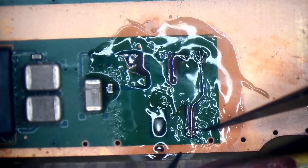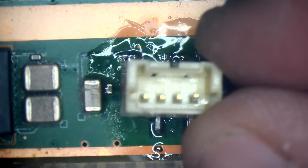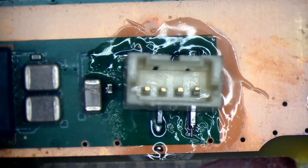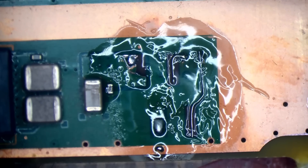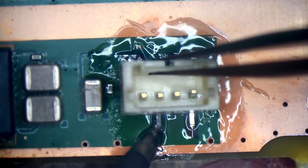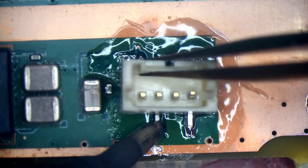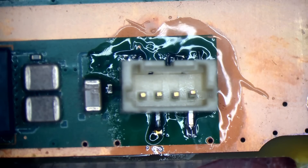Let's try and conform to the original trace. I don't think length matters but I'll try and get it to the right length. There we go. The third one isn't going to make a difference because I can just bridge that one — it should be close enough. Now I can put the connector back on. Grab it with the tweezers, flow the ground pad. I want to try and get it as close to the original position as I can. I can always run a jumper wire after the fact if it won't bridge for that other one.